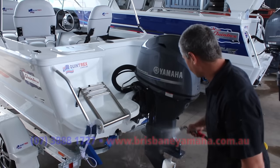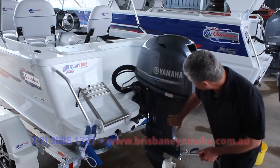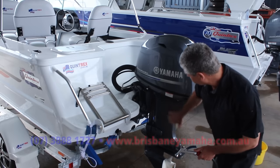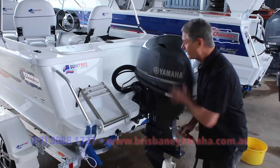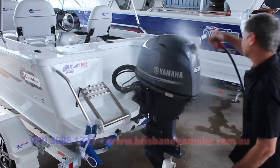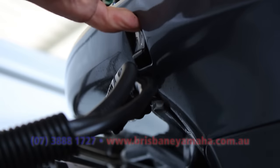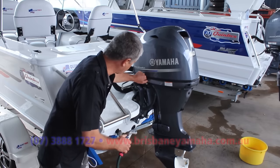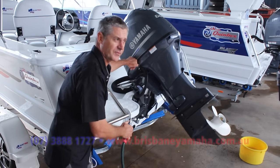Once you've come back from a day out on the water, give the motor a good sponge down. You can see where we've previously sprayed it with our silicon spray and lubricant — it just runs off, a bit like polishing your car, so you know you've got that film of protection on there. We're going to do this to our whole boat. Make sure you get into those tricky spots, get that fresh water in there, and hose off the salt.